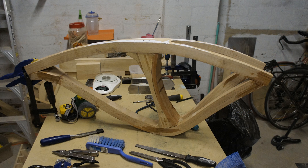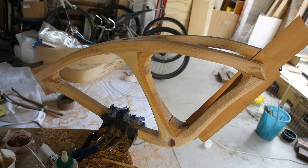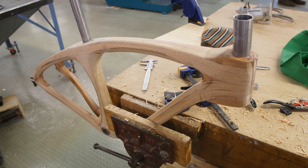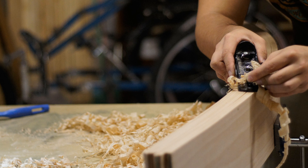The technique used to craft this frame is a process called glue laminate. This is where a piece of stock timber is re-sawed into veneers and reassembled with adhesives between the layers. This ply technique increases the strength-to-weight ratio of the timber and helps to overcome natural weaknesses such as grain direction and knots.